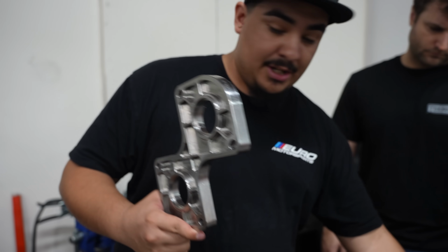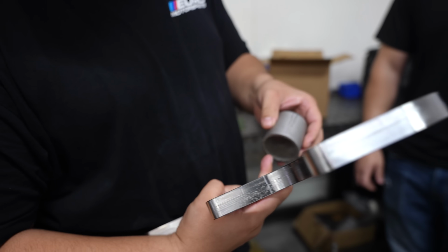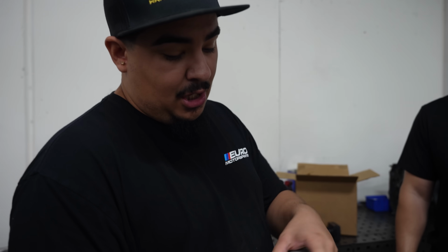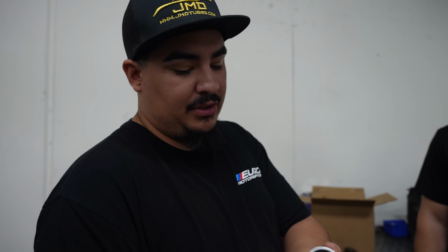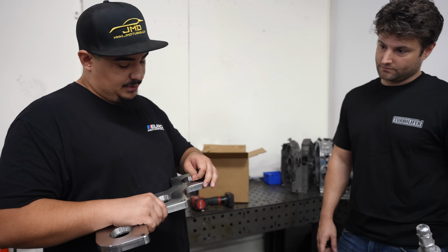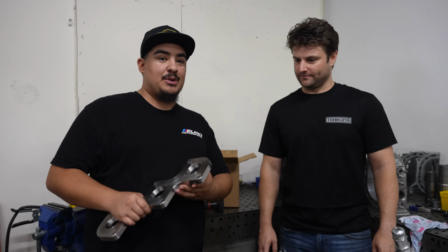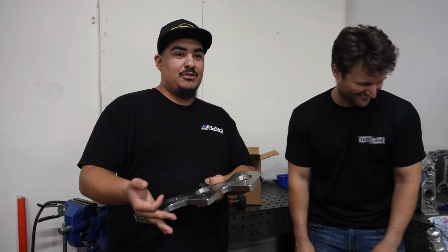And then this tapered edge on the inside. Once this is done, this is gonna be perfectly tapered to the inner diameter of this, which allows me to fuse this weld in here without any effort. So this thing will be the best thing I've ever welded to as far as rotary flanges. So now tomorrow I'll go get the material for the 6 rotor, 4 rotor, 2 rotor. You son of a bitch.